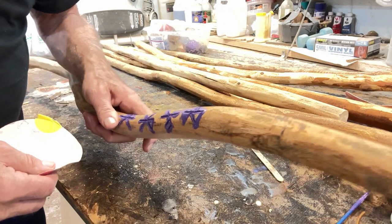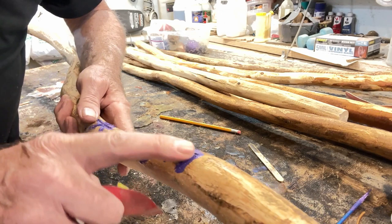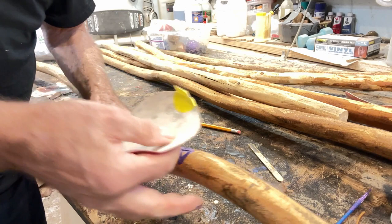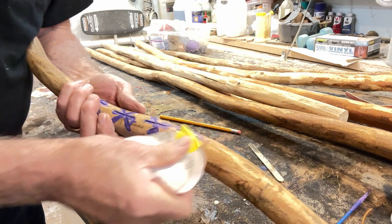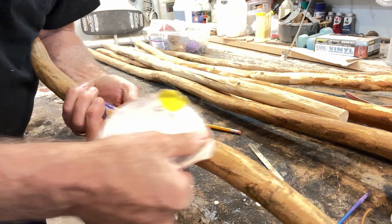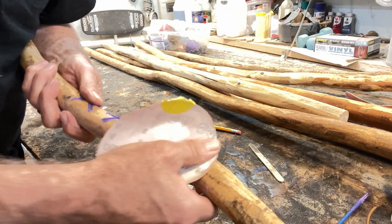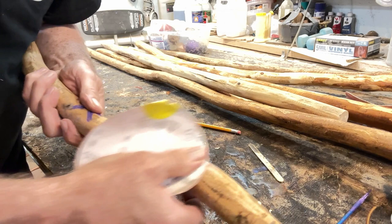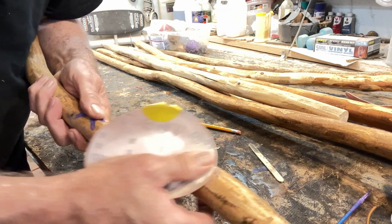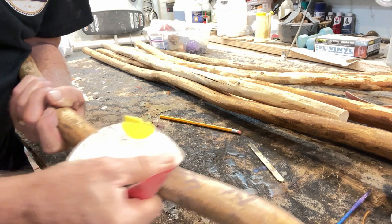Now I'm going to show you the purple acrylic paint I put in the runes. It has dried and is ready to sand. I take a little 150-grit sandpaper — you could use 180, or even 100, but I use 150. It doesn't seem to scratch it up too bad, and it cuts that acrylic right off using just my thumb. I don't like to use the power sander because it tends to take off all of your previous stain. I just want to take a minimum amount off, and it'll lighten up a little in the area where the runes are. Sand until it looks like all the purple is off the wood, then take your air gun and blow the sawdust out of the carving — and it'll show that bright purple again.